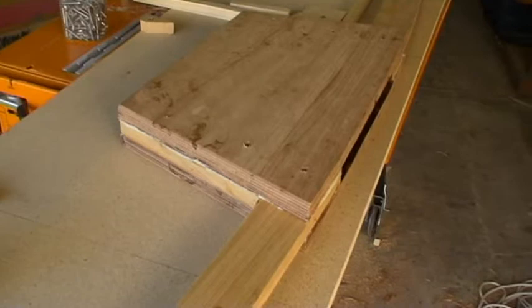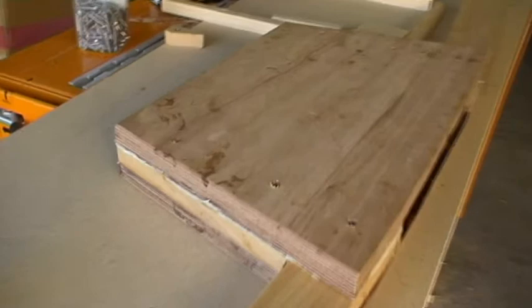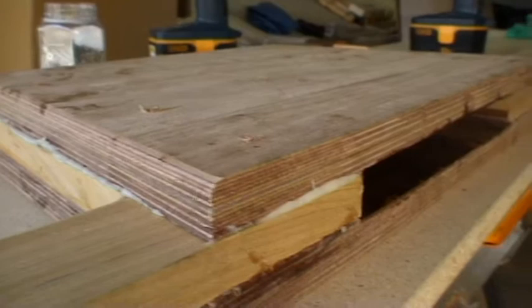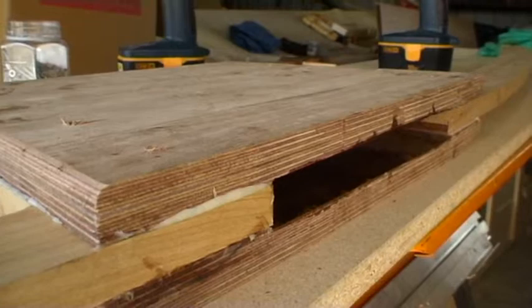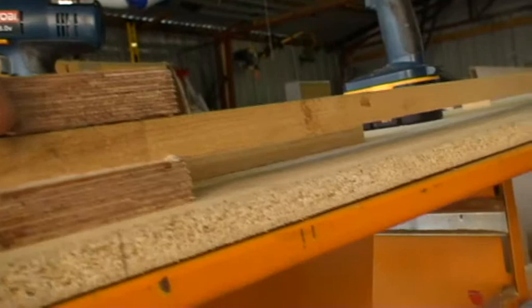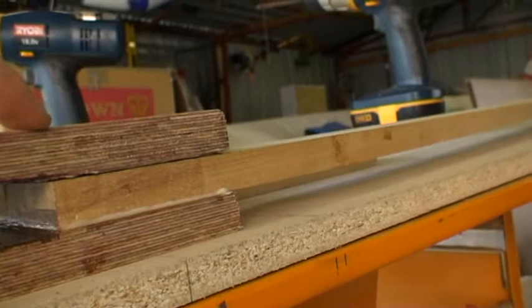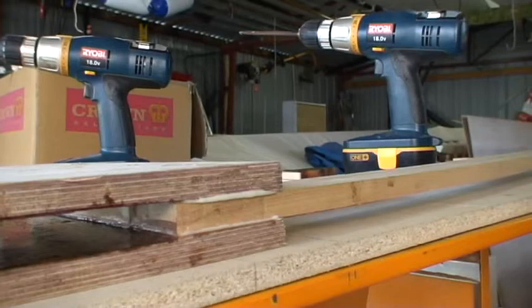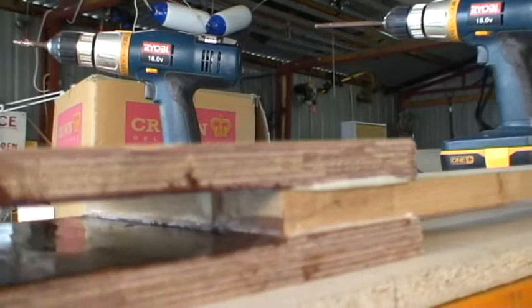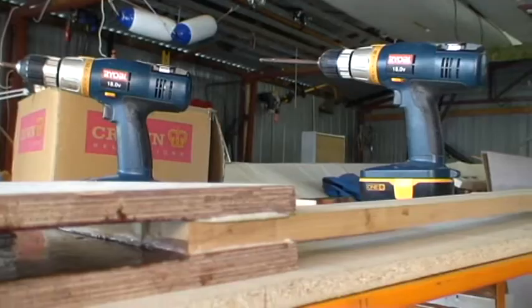I've now glued this up and just put the top on — I thought I'd show you so you get the idea of what you're looking at with the glue. You can see down here just that narrow squeeze out of glue all the way down the side. If you're not getting that much squeeze out when you put it together, you probably haven't got enough glue in that joint. From under here we're not getting any squeeze out, and I don't think that's a glue problem — it's basically the screw: we're not getting enough screw pressure. I'll back off that screw and have another go. There we go — you can now see a nice squeeze out. All I did was back out the screw in the top and put it back in again. We can see a little bit of squeeze out happening inside that we'll just need to clean up as well, and then it's ready to go on the boat.